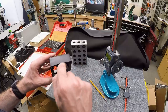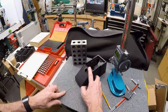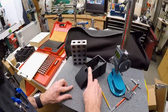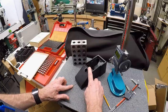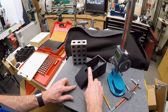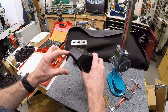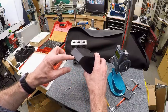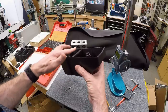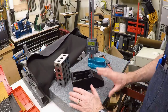I did forget to measure the draft on the bottom. Since it's symmetrical I just need the height in the center, and I can do that with a gauge pin by laying this down and feeling with the pin. This pin which is 76 thousandths will just fit through right in the very center — you can hear it rubbing — but one thou larger won't slide in at all. That gives me the draft, and from that I can calculate the correct angle, or just draw it up in Fusion 360 with that measurement and a couple of lines.